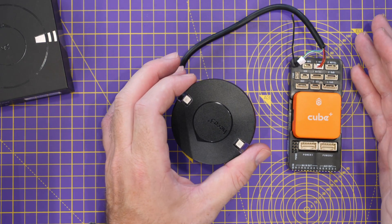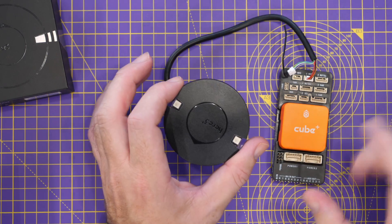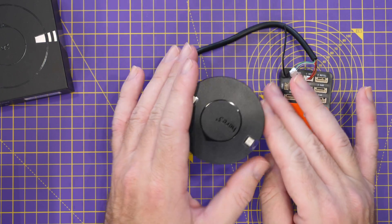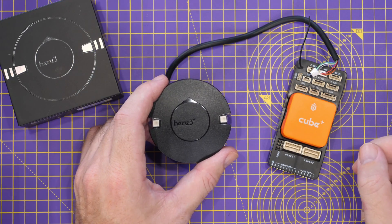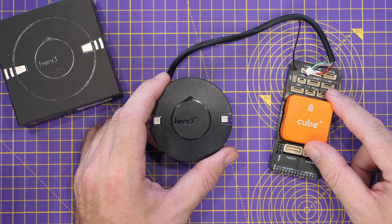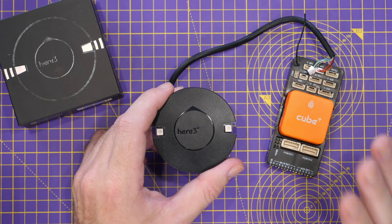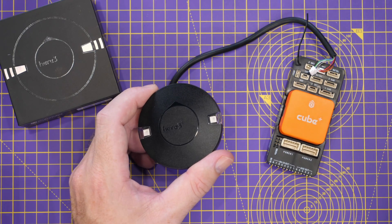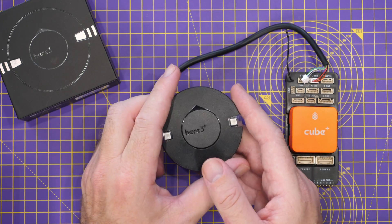This is a much improved version of the original CAN bus setup in ArduPilot. There has been a bit of moving around in the world of CAN and drones; however, we now have this open-source CAN protocol that ArduPilot, the Cube Autopilot, and the Here 3 fully supports. It's going to be super interesting to see what use cases we get for that new CPU in the Here 3 — the STM32 H757 running at 400 MHz, 2 MB of flash, 1 MB of RAM. You will literally be able to use this as a fully-fledged autopilot in itself in the future, especially in situations like Boat and Rover.